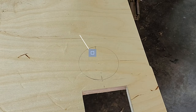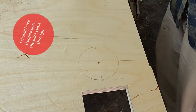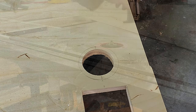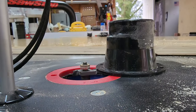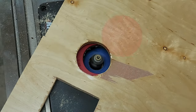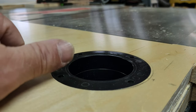This is an addition - the router table fence does need dust collection. So I thought I'd add it into the table. I didn't want it sticking up or a hose coming up through there. So my fix is to drill this out. Luckily, I found the right size bit to bore that hole, and using the right combination of that bit with a rabbeting cutter to get just the right depth to sit that in place. Now that's just below the surface so it won't catch on anything. Put a couple screws in there and we're good.